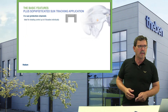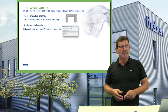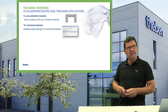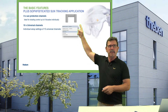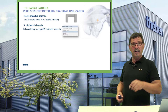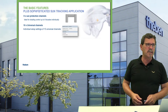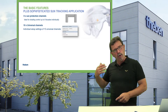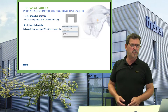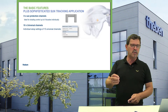For further applications of MeteorData: we offer eight sun protection channels. If you look at a building with eight facades, you need exactly eight different sun protection channels, and that's exactly what we offer through universal channels built into the MeteorData application. Additionally, you can set threshold-based commands: when a specific rain level or wind speed is exceeded, send a bit command or byte command — whatever you like — to trigger functions or safety channels.